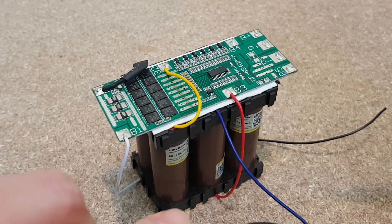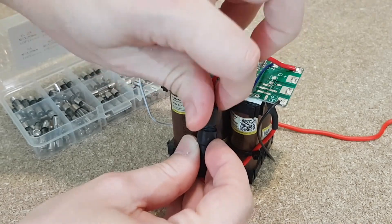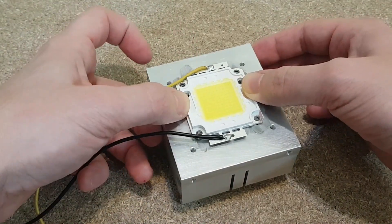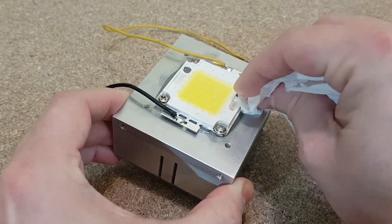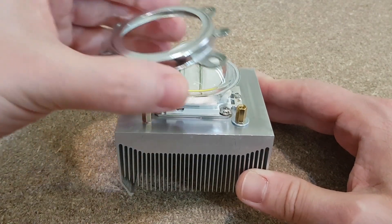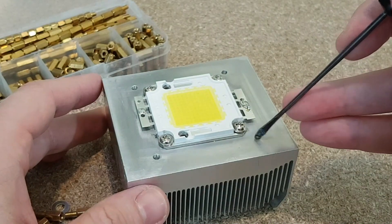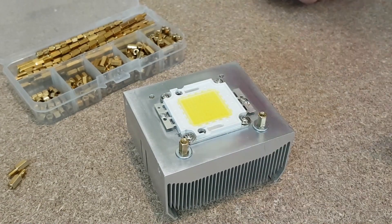It's time to solder the balance leads — I'm using wires of different colors because it's easier to follow the schematic. On the positive wire of the battery pack I solder the fuse holder and I will add a 10A fuse. The LED is next. For a better heat transfer I will add thermal paste between the LED and heat sink. Now I can tighten the LED with 4 screws. I left it for an hour so the excess paste is pushed to the side — I can clean it now. For the LED bracket I will use these metal standoffs. These are the best I can fit here, but still they are 2mm shorter, so I will add a small metal washer under each standoff — now they are the perfect length. I will add a tiny amount of grease in each hole to help the screw slide in easier and protect the internal threads. I bought a kit with standoffs of different lengths — they are very useful.